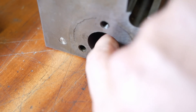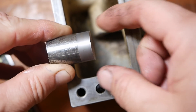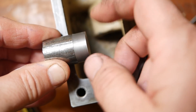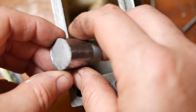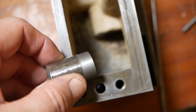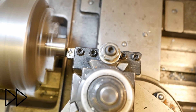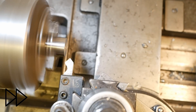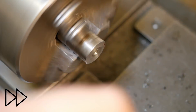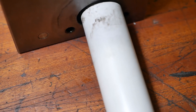I've had a bit of a think about how I'm going to stop this bore and the other bore further in from getting damaged when I sandblast. The inner bore is 22 millimeters and I found a piece of scrap which already has a 22 millimeter feature. But just in case it gets stuck, I want to be able to pull it back out — I'll face off the end, put a hole in it, put a thread in it so I can always put a bolt or something on it to pull it out. Even a slide hammer if necessary. I found some plastic that will fit nicely in here, so I chopped a piece of that. Now it's all taped up and it's off to the sandblaster.